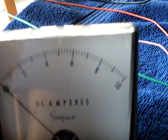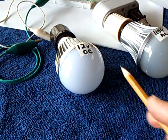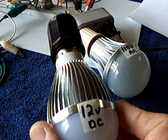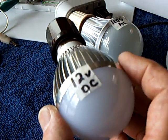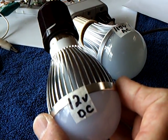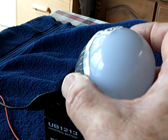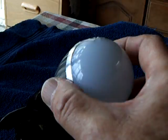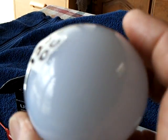Here's my amp draw coming into the system — nothing. I've got three bulbs here: two 110 volt AC and a 12 volt DC. I bought the 12V DC bulb to compare to the AC bulbs — it looks just like the AC bulbs but there's no AC guts in it. It's a 450 lumen bulb, pure white light as opposed to warm light. It's very bright, and you could use it straight off a battery. You could make a 12 volt lighting system using just that bulb.